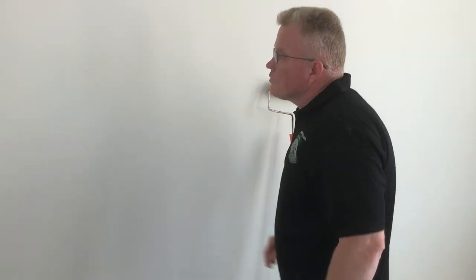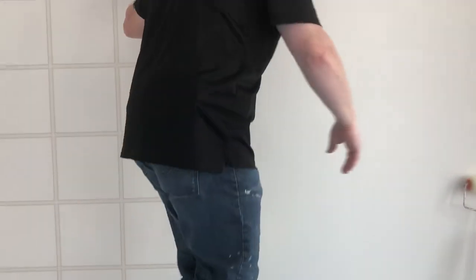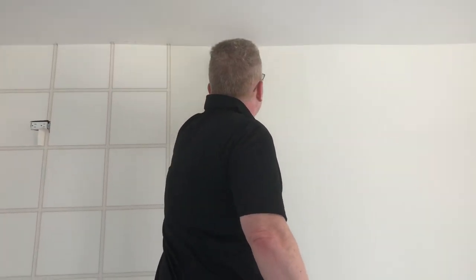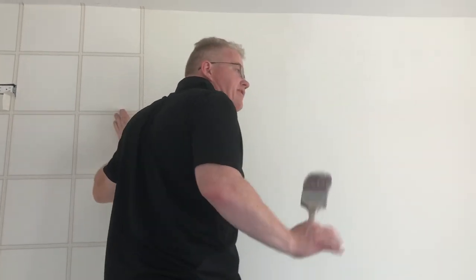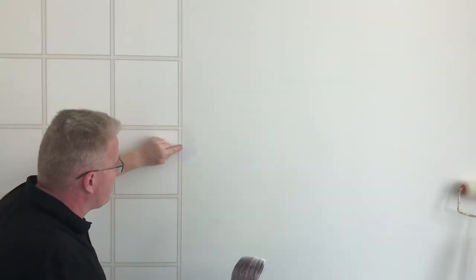And there you have it. So you're going to glue the wall, and use a piece of paper to protect the ceiling. Of course you don't want to hit your ceiling with glue — just go up at the top and pull that glue right to the corner. It's a very thin layer of glue. You don't want it thick, and you certainly don't want it oozing out on the edges.